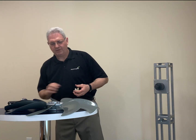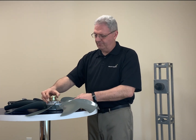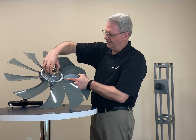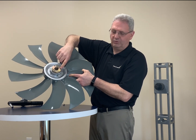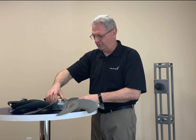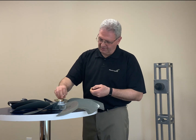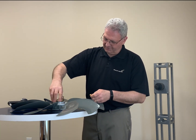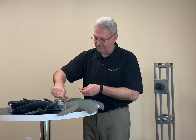Once those three components are clean, you're going to want to insert the bushing into the boss. It's important to line up a clearance or free hole on the bushing above a threaded hole on the boss. This way, when you insert the three bolts and tighten them down, they'll draw the bushing into the taper of the bore and tighten it securely on the shaft.